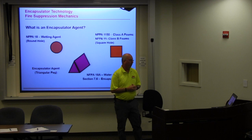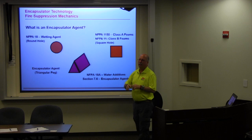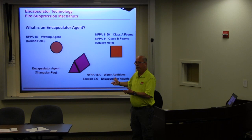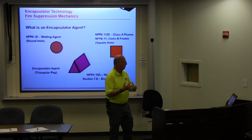That's the one that encapsulator technology falls under. So when people come along and say, hey, I have a product that's just as good, it's even better, but then you look at it and it's a Class B foam. Well, how can it be better if it's a Class B foam? You can't meet this NFPA 18A test standard, so you can't be better. The only standard you meet is the NFPA 11 Class B foam standard, which is tested for burn back resistance and other things. We'll discuss a whole bunch of things, what we can do, and what makes us different from Class B foams as we go through the program.